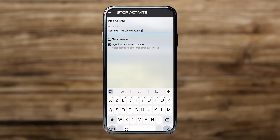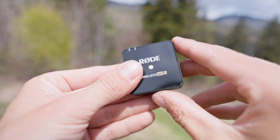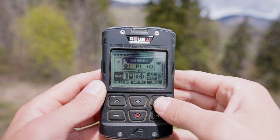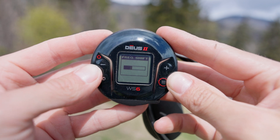Back to interference. What are the solutions? The first is obvious, but not always feasible: eliminate the source of the interference. Momentarily turn off the electric fence with the owner's permission, move away from it, turn off the wireless device causing the problem, or avoid using your detector indoors. If that's not possible, a few settings can improve the DEUS 2's stability. The first is frequency shift, either automatically with the scan function or manually. Simply press and hold the ground button in the top right-hand corner of your remote control or the minus button on the WS6 master. The device automatically selects the frequency with the least interference.